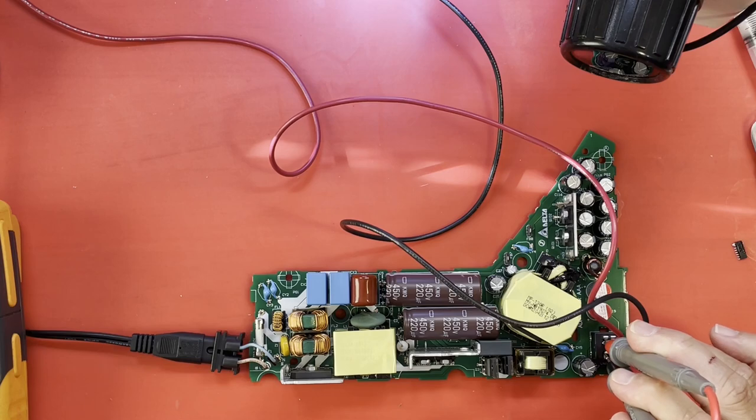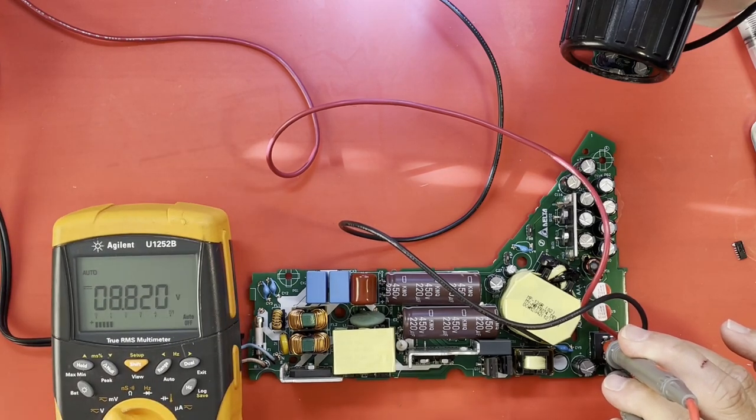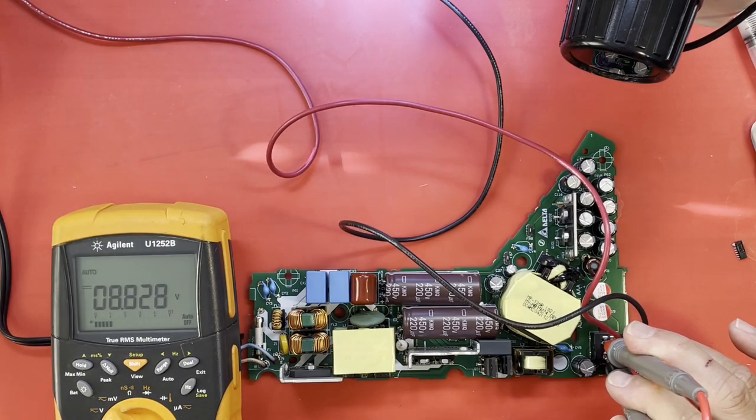You're not helping, cord. Okay. Load is still on. Let's see what happens. Okay, 8.8. We have a problem still. I don't know if you can see it, I'm sorry. Make sure there's 8.8 volts is what we're getting out, not the full 12 volts. That's an 8 amp load. If I bring this load down, 7, 6, there's 6 amps. She's still 8.6 running around, so we still got a problem somewhere. Okay. That's how it wants to be. Turn it back off.